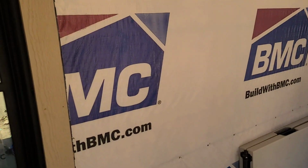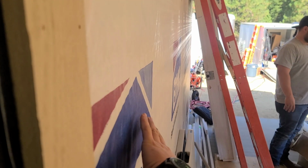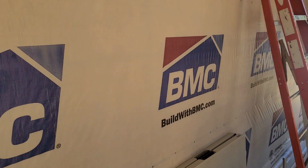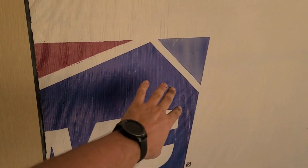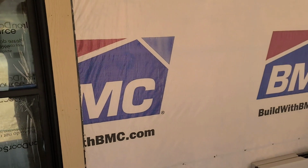Okay, so they're doing a pre-test on the house to see air leakage, and we'll see if we can see this. Looking down, the little bit of house wrap is all puffed out, and that's at 1.74 ACH 50 on a spray foam house. So that's already a code compliant house, and that's how much leakage comes through the foam and the little cracks that it still pressurized the house wrap.